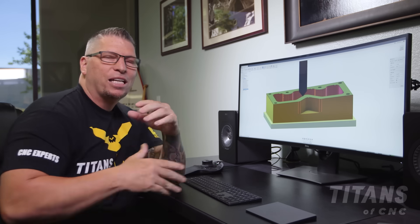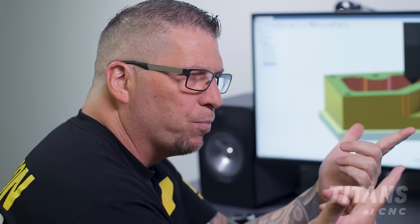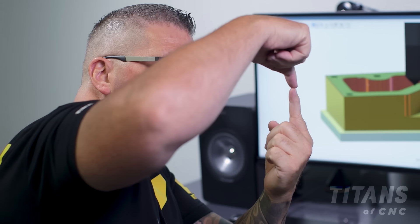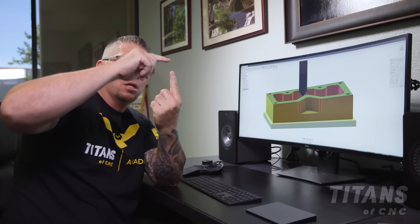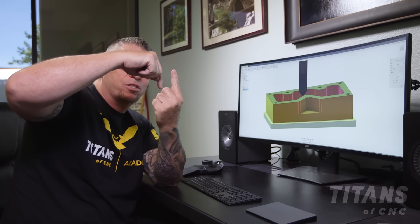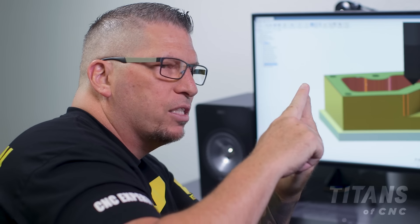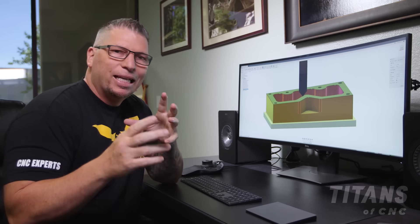Each side is 45 degrees — that's why it's popular in machining, especially manual machining, because it's easy to calculate. With a 45-degree angle, to create a chamfer you go edge to edge: if I want to chamfer an edge 5 thou, I go 100 thou off and 100 thou down, then an additional 5 thou. Because it's 45 degrees, it's equal — 50 over, 50 down; 100 over, 100 down creates edge to edge. Anything beyond that is the chamfer.